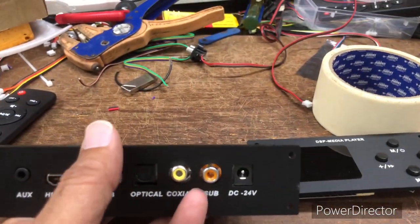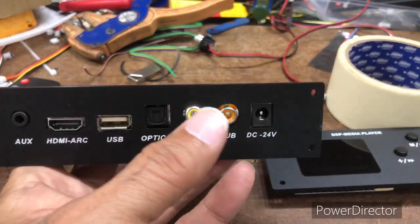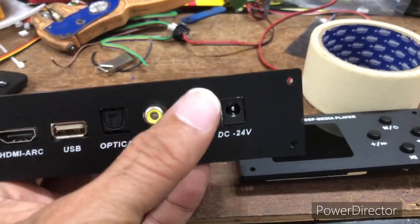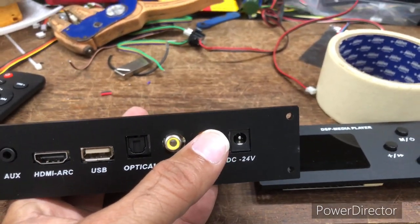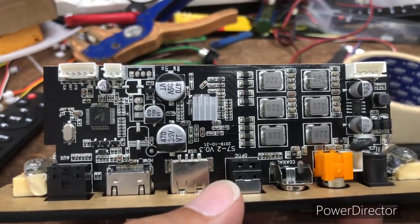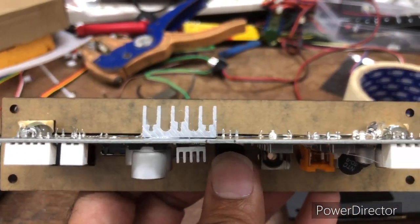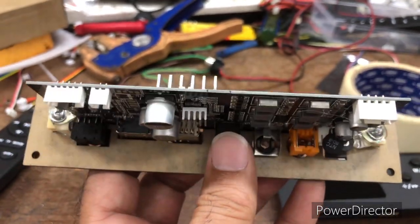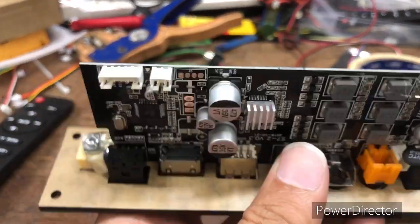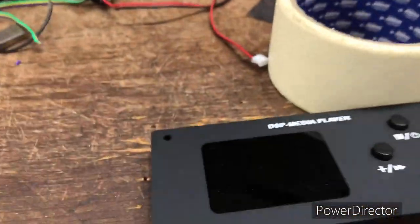The amplifier for the subwoofer is built in, and left/right channel output is also built in. Input voltage is DC 24V, 5 to 8 ampere — 200 watts is sufficient for this board. The build quality is excellent. This is the Class D IC at 120 watts. The kit is 120 watts total: 30+30 watts left/right channel and 60 watts subwoofer. No extra amplifier is required — just connect the speakers. There's a heatsink on the IC front and back, so no fan is needed.